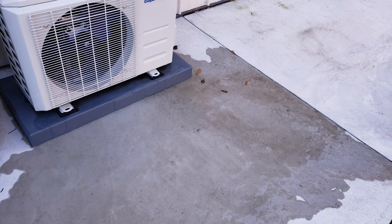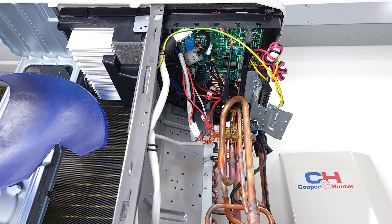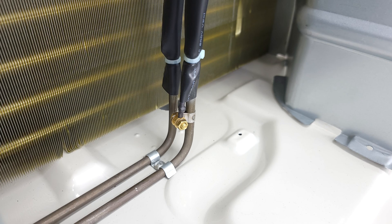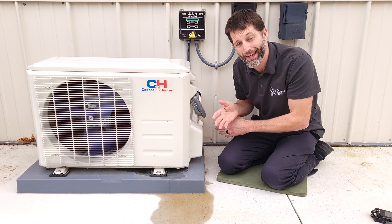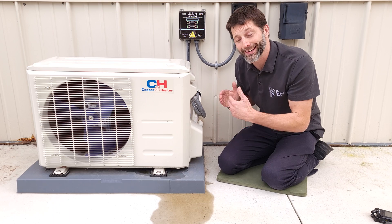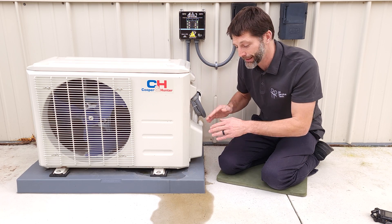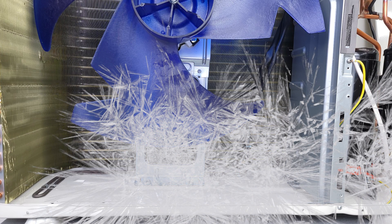It's not only when defrost is occurring, but usually after defrost as well, and it has to do with the programming in the main brain of the system, which is the outdoor unit PCB — that's a printed circuit board. The base pan heater will be powered down here in the base pan. If a system runs for a long period of time and has to run into defrost again, the system may decide to run the base pan heater, heating up any liquid in preparation for defrost to occur again. It just wants to make sure that water dripping down does not drip onto ice, which could build up into a solid block of ice that gets up into the outdoor unit fan and causes it to get stuck.